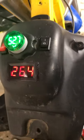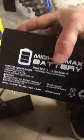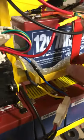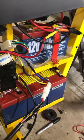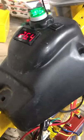It doesn't matter what type of battery you have, you really want to keep an eye on your voltage, because if you deplete it too much, it damages it. We got sealed lead acid batteries here. These are meant for deep cycling, but you don't want to drain them too low. And obviously any lithium battery, if you drain it too low, is going to damage it. These have BMS, battery management systems, built into them, so you can't go too low. But with these, you can start to feel the machine slowing down and you go, I better get home. With any type of lithium battery, it's all out until there's nothing left. So you don't want to be stuck out, you know, hundreds of yards away from your house. So this will help me monitor when I need to start heading back, by experience.